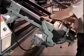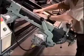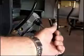Here are a few tips to help you along this process. Pre-assemble your frame directly on the Door Master or at an adjacent workstation. Align the lower left corner — the reference corner — manually in the Door Master frame. Shift the clamping valve to the second position. If the Miter Door Master is set to the manual pre-clamping mode, press the miter buttons to close the clamps in manually.